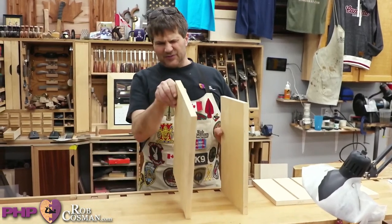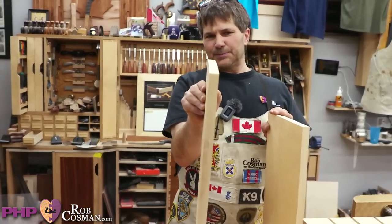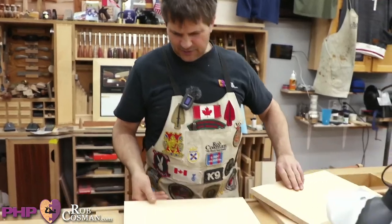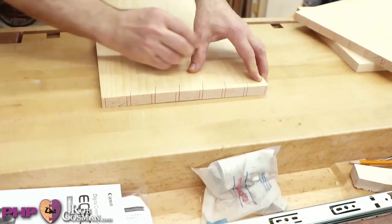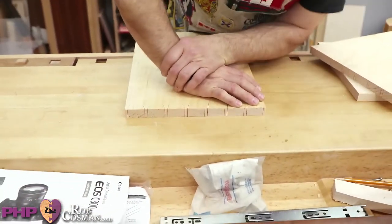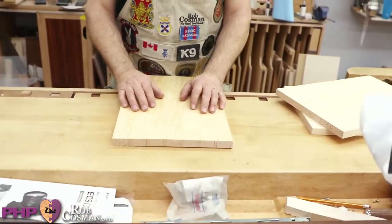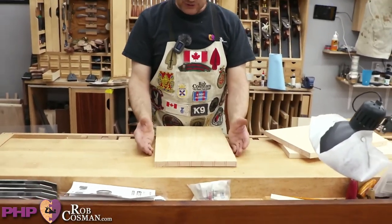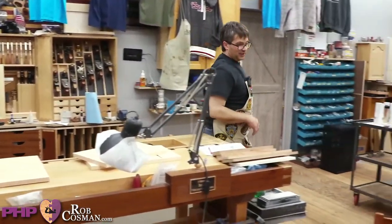And these pieces of pine, if you look, can you see that, Jake? See how much that is cupped? Can you see it? Okay. So if I put that down on a flat surface, like so, you can see where it's cupped. But it doesn't take a whole lot of weight to flatten it out. See that? So you can prevent a board from cupping. What you can't prevent is it expanding or contracting. That's where it has incredible power. So when you're talking cupping, it's not hard at all.